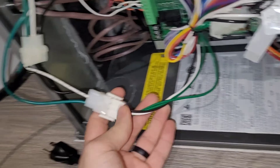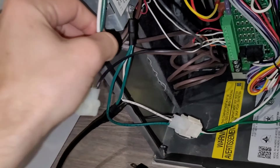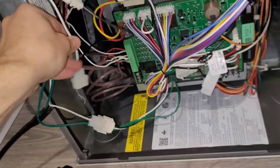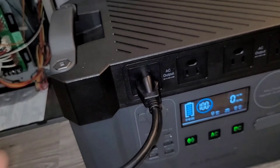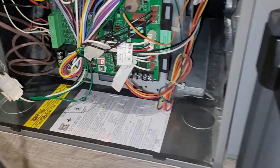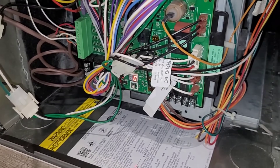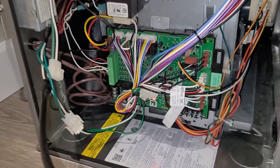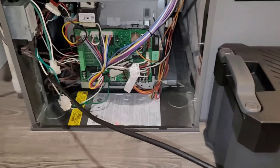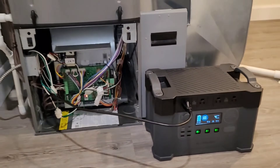Disconnecting this fully prevents any back-feeding to the panel — the risk of the furnace being powered twice — and pretty much eliminates any safety concerns we might have from incoming power. So we plug in and we're done. If you have this cord made before a power outage, you can be up and running in less than a minute. Take your cord and plug it into either your solar power station or run it to an extension cord and take it outside to a gas generator. As long as you've taken the voltage off the neutral and you're sufficiently grounded, you should get no error codes.